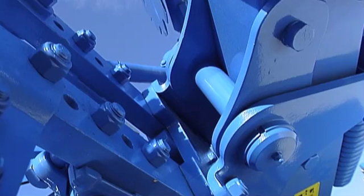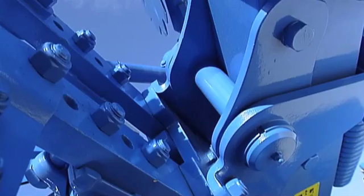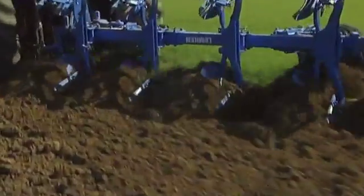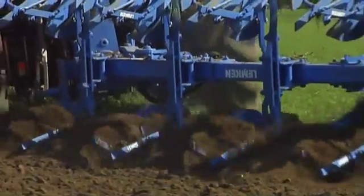The pivot of the VARI pivot bracket is located between the plough frame and the leg bracket, close to the adjustable plough bodies. This not only increases stability but also minimizes the strain on the pivot points and components. All components can be replaced separately in case of wear.